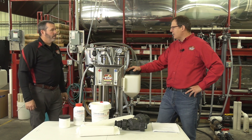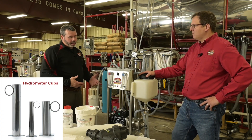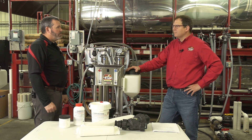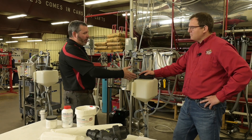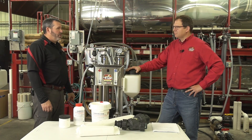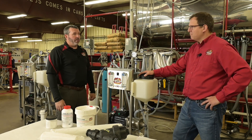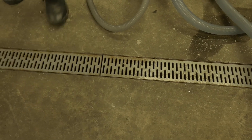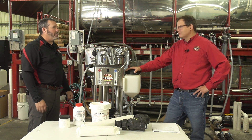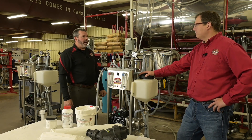Anything else you recommend as far as parts and pieces? How about testing? To test your concentrate, we sell hydrometer cups with hydrometers, or you can use a handheld refractometer. The refractometer is really ideal — because you can tell with some light, you can really tell. pH meters may also be useful for testing your liquid inside your wash tank or testing your sap. pH meters are recommended as well. How about the drains in the sugar house? Drains are pretty important — I've seen a lot of sugar houses without them. I would strongly recommend, especially if you're a new operation, to put a drain in the sugar house, kind of like we have here on the floor. This channel drain is key. If you can get channel drains in a sugar house, lots of people are doing them now. It works out really nicely to keep the floor clean as well. Because you've got rinse water that's got to go somewhere, and a drain is recommended.